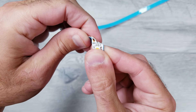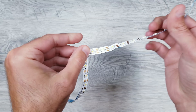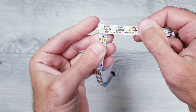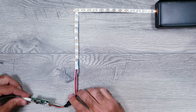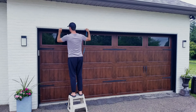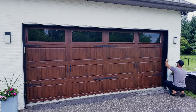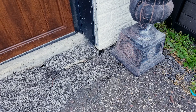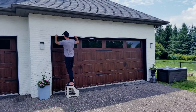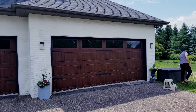I've only done the bend method on LED strips with 30 or 60 LEDs per meter because you actually have a little space between the lights. If you try this on non-COB LED strips with 100 or 144 LEDs per meter, I can't speak for those results. But here you can see it's working perfectly fine. This made the rest of the installation go super fast, and it's always one of my favorite parts putting the lights in the profile. Once I got to the end, I cut off the extra lights — for this side it almost used up the entire 10 meters. I then snapped the diffusers back in place, with everything laid out the way they came off so it all lined up perfectly.